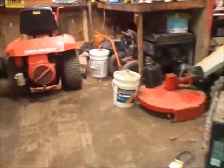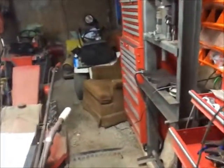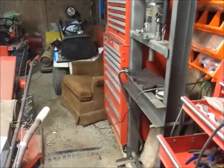We're going to go inside and get my torch and heat this up. Because if you heat it, a lot of times the heat will let it stretch instead of stress crack. Which, this may already be stress cracked, and as soon as I go to screw with it, break it. But, you know, wait and see what happens here.